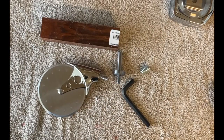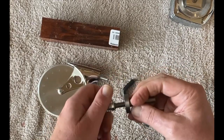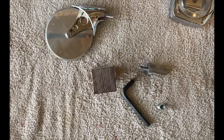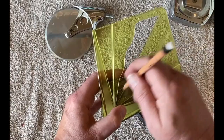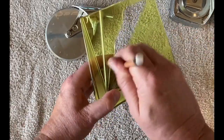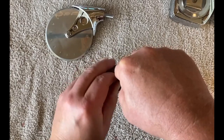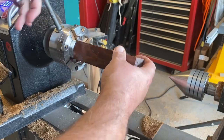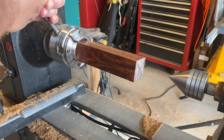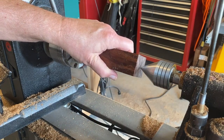Almost like you would a pen blank — I got a mandrel for it. We just kind of start out like a pen blank, get the center done. Like all blanks, they're not perfectly squared. Take a self-centering punch; you can see the lines on it aren't quite there. Kind of line it up and whack an indentation in it. Then we'll go over to the drill, get it drilled out once we get it on the lathe, and get it lined up a little better.